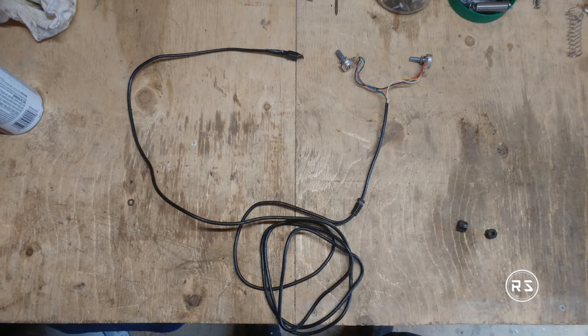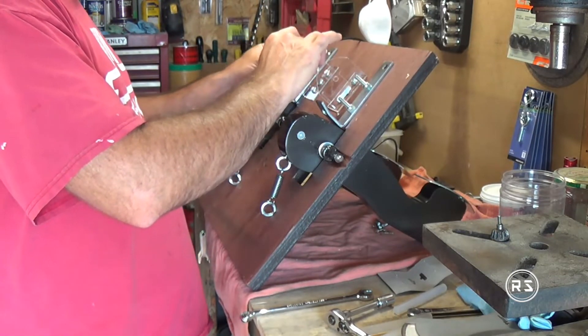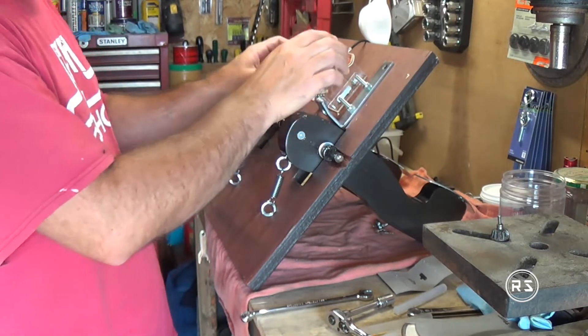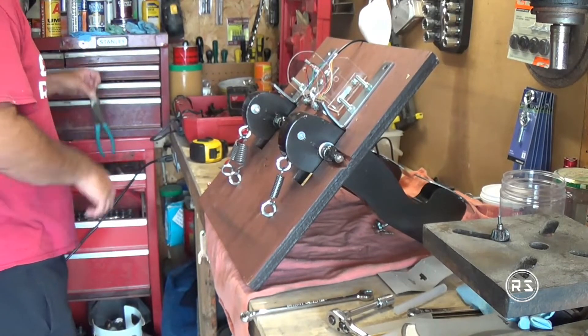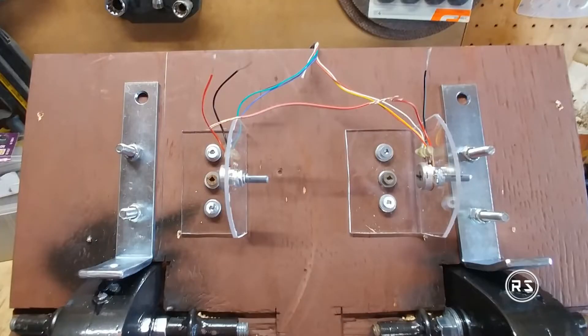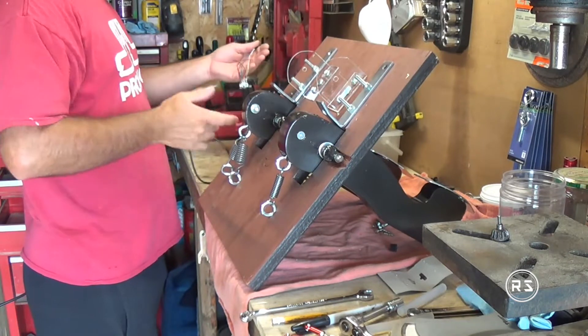Since I didn't want to wait for shipping to get my new stuff, I decided to build this pedal set with the hardware already in the original Thrustmaster pedals, and I will replace the potentiometers when I receive them by mail. Since there's a little bigger distance between my two pedals compared to the original, I needed to cut those two wires and make them longer so the link can be done and the wire won't be too stretched.